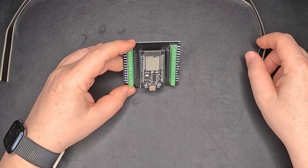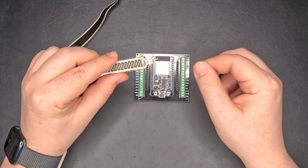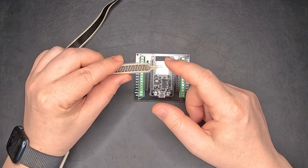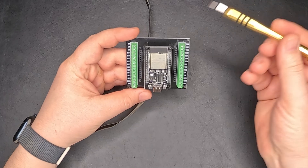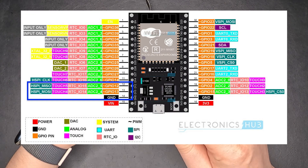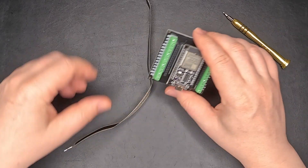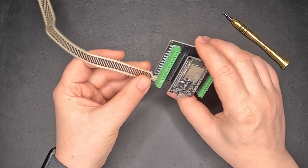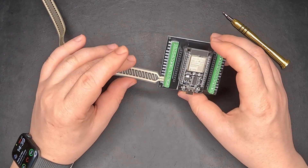In terms of connections, all we need to do is connect this resistor to the ESP32. As you can see it comes already open-ended. It doesn't matter which pin goes where, but as a short description we will be connecting ground with pin 13 for the first band and ground with pin 12 if you're going to use two bands. In theory we can simply plug it in between ground and pin 13, but that would limit the mounting options a lot since this will sit actually under the mattress.